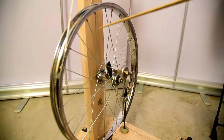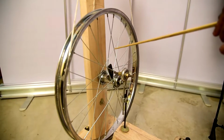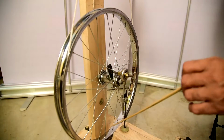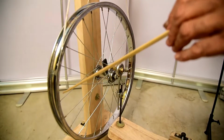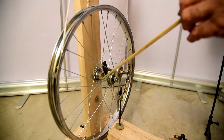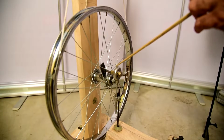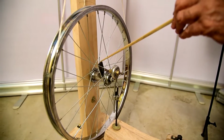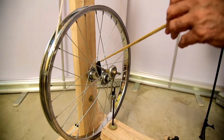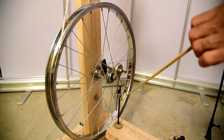This is a band wheel. The band wheel is 410 mm in diameter and 910 gram in weight. The pitman rod is connected by a nut bolt to the middle of this band wheel, and the band wheel is the main driving force of the entire machine.